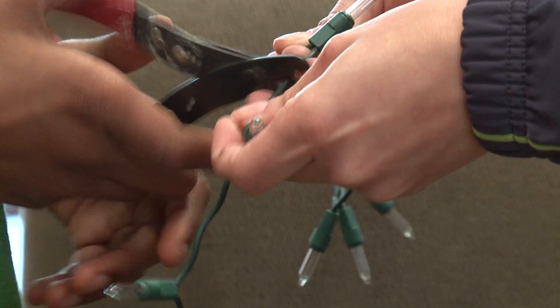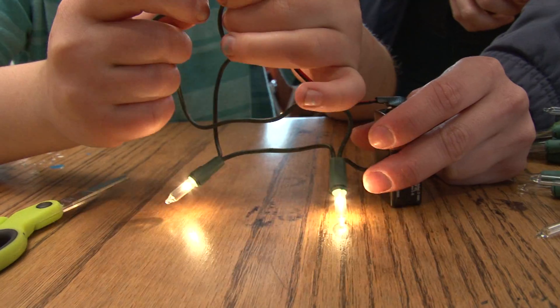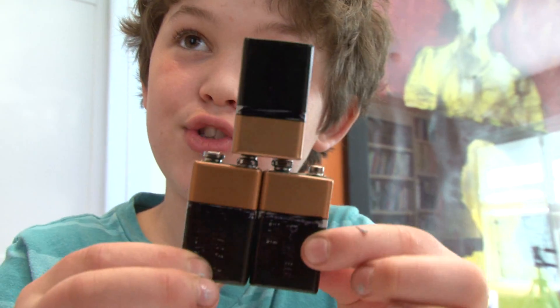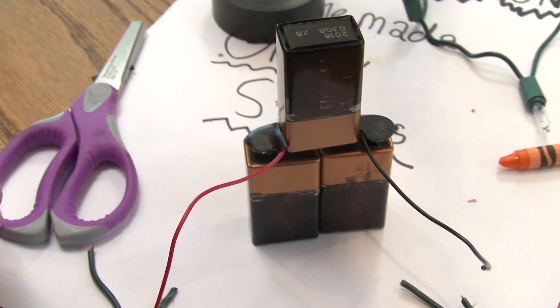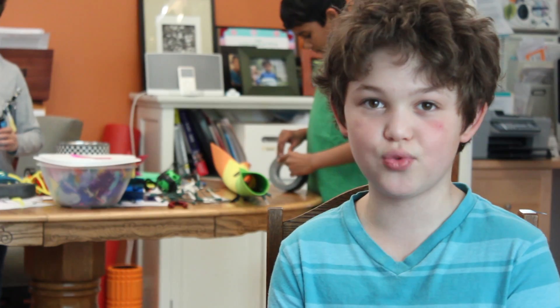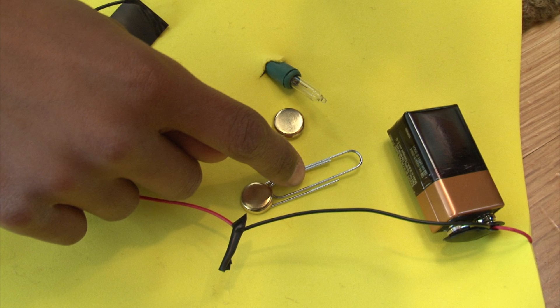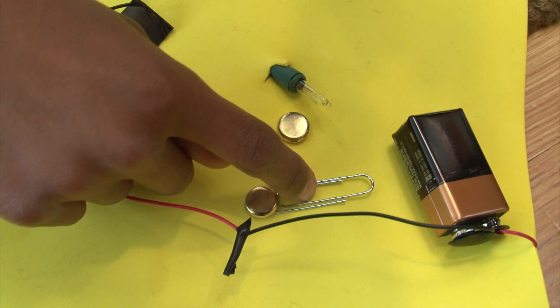If we have more than four mini lights, we have to have more than one battery, or it will be too dim and the effect will not be as good. There are ways to combine the batteries to increase the voltage. I've hooked up three 9-volts and connected up to my glowing ball — this will give me the power of three 9-volt batteries. Arun also made a switch. When the paper clip connects the two brass fasteners, there is a closed circuit. When you open the paper clip, the electricity can't flow through the circuit, so the light bulbs don't turn on.